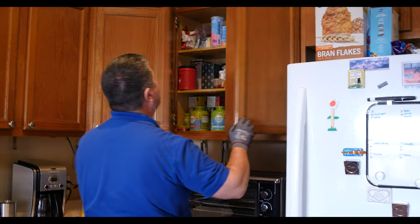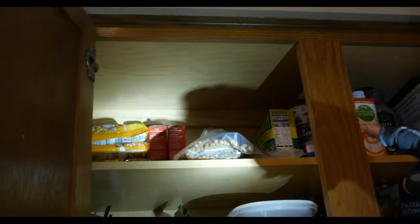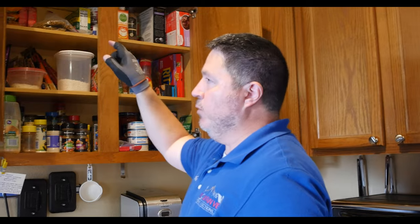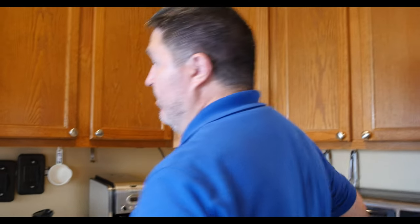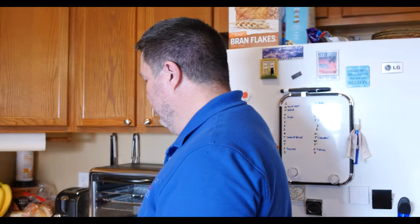Walk back over and take a look at these cabinets. Sometimes like in this home you can look at the screws and see they're not necessarily the cabinet screws — those will have little washers on them. Those will probably hold and look like they've been holding for a long time, but sometimes they're held with drywall screws which are not made to hold up cabinets. Point that out to your client. If the husband is looking for a project, you can walk him through replacing those screws with actual cabinet screws — gives them something to do and start off being a new homeowner that way.